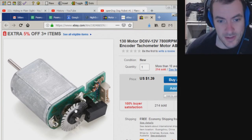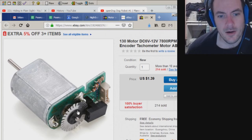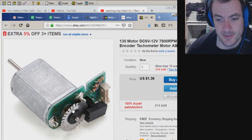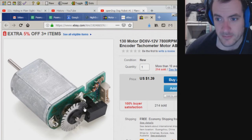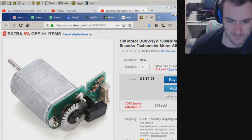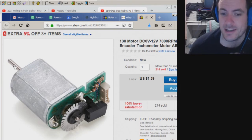And with the resolution of this being about, I don't know, 4 degrees, one full turn would be divided by, I don't know, it looks like 60 times. So it's really pretty fine precision, considering one full turn of this would just reel my string. I don't know, a linear translation of a full turn might be 3 millimeters, and we've got 3 millimeters divided by 60, so we're talking like 0.05 millimeters. This would give me very fine precision, and it can count indefinitely.